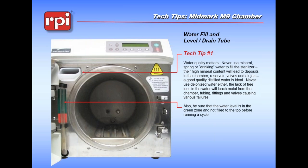This note about water levels is kind of funny. Occasionally we'll get a call from somebody who says their customer was running the machine and there's a huge puddle on the front of the machine but they cannot find a leak. What we finally tracked it down to was they were filling the machine all the way up to the very top. When the steam comes back into the reservoir, it tends to boil and bubble the water, and that bubbling is transmitted through the reservoir into the tube and blows the water right out of it. So don't fill it any higher than maybe an inch or two from the top and that will never happen.